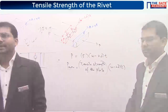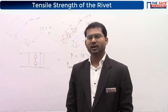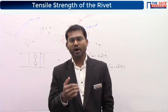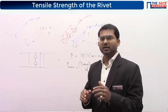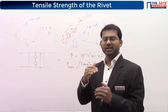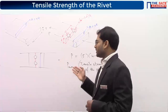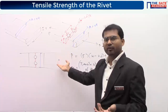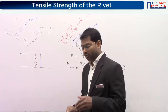In riveting design, we are not concerned with yield strength or ultimate strength distinctions in the usual sense. Our objective is avoiding failure of the joint — the joint has failed only when breakage happens. Many people think it corresponds to yielding and take the yield point, but it is based on the ultimate or fracture point, because in real scenarios there is very little difference between them. Even if yielding occurs, the two plates are still intact, so we don't take yield point for these ductile plate materials.